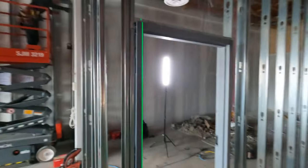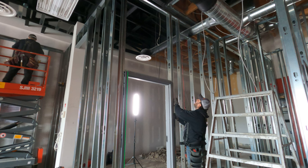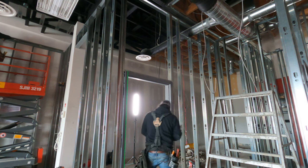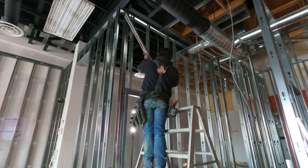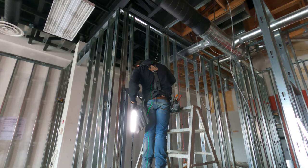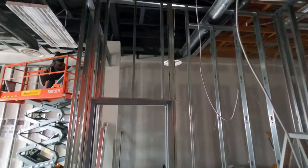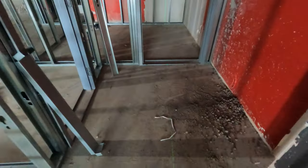I'm pushing over my second door stud and pushing it up nice and snug to the door studs already squared and screwed in — that closes off access to the clips. If you're insulating these walls, insulate between those studs as well. You can see how my knockouts line up — I measure down from a cutout, make a mark, then measure from that up to the overall height. Here's an example of one of those doors with the clips. When drywalling, always level the hinge side first and you're golden. I always pre-square over my marks and screw both sides in.